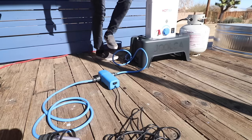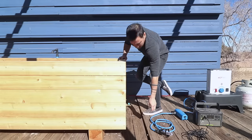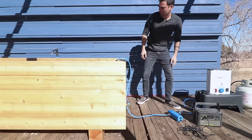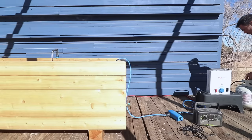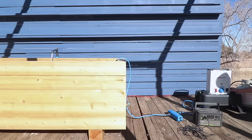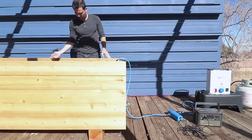This is really easy — you just plug in the filtered inlet, plug in a hose to replace the garden hose, and then I just plugged it into my Goal Zero. This pump is designed for camping applications, so it's meant to be plugged into a 12-volt outlet on a car. I just plugged it into one of my Goal Zero power packs, dropped in the end of the pump that has a filter on it, turned the propane back on, and now I was cycling the water from the tub through the hot water heater, heating it up, and back into the tub.